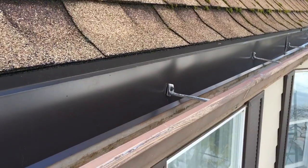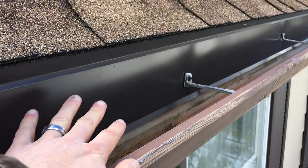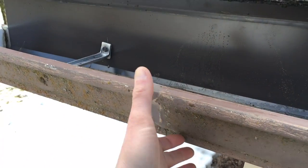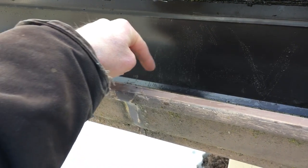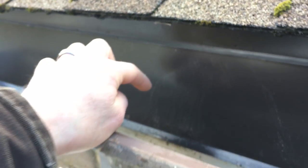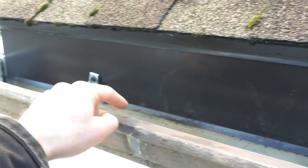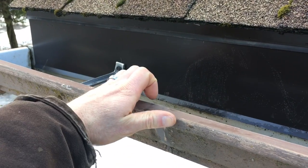Here's a long section of gutter that I just finished fixing. What was here before was this rain gutter was not fully attached to the fascia. It was basically slung — there used to be a strap that went all the way around the gutter, an aluminum strap that wrapped around the entire thing. About at the mid-span of that cross piece, there was a bracket — you can see the remnant right there — and that bracket just riveted to the center of the cross piece and suspended the gutter from basically just the roofing. It was tucked under and nailed under the shingles, but it suspended it and made it so that the gutter wasn't firmly attached to the fascia. So you could literally take the gutter and swing it out like this.